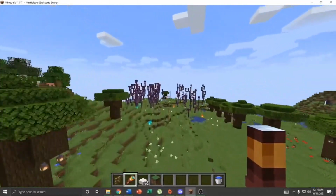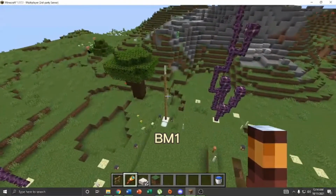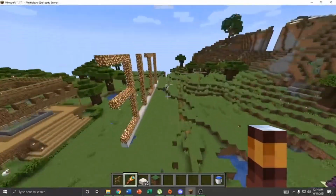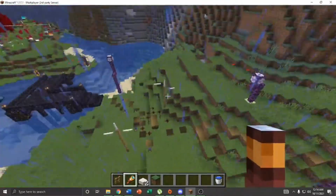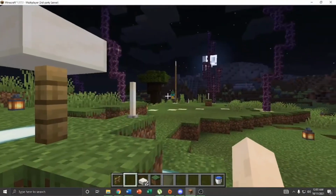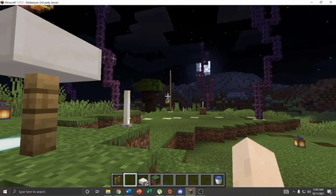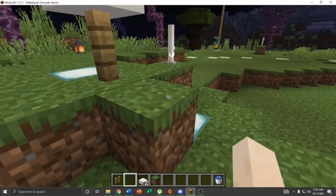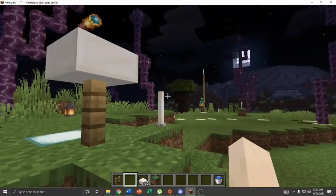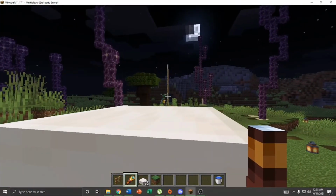In the procedure of the fieldwork, the chief of party first designates benchmarks 1 and 2, which will have a distance of about 300 to 500 meters from each other, with significant differences in elevation. BM1's elevation has to be either known or given by the professor. The instrument man then sets up the precise level at a suitable distance away from BM1, while a rodman holds the leveling rod at BM1.